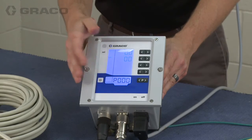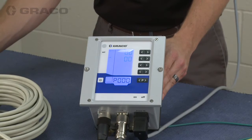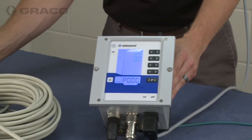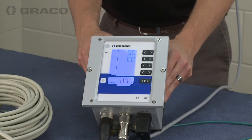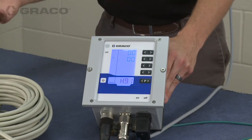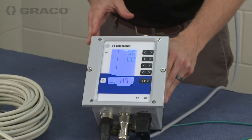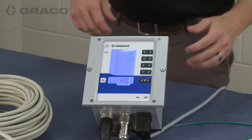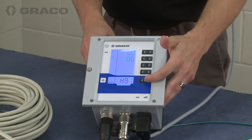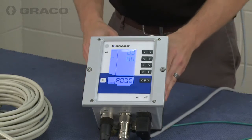From this screen you will also see error codes. If we unplug the gun cable, after a few seconds you will see an error pop up. It now displays H91, which is the error for not being able to communicate with the gun cascade. You'd address the issue — in this case, plug the cable back in — then to acknowledge the error press either the right or left program button and the error code is gone.